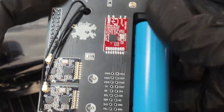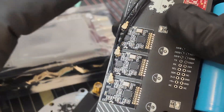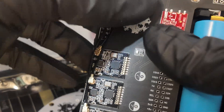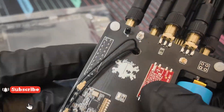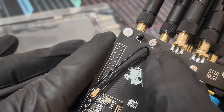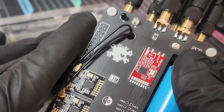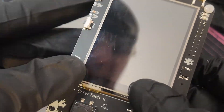This device is powered by a single 18650. You've got a CC1101, three NRF24s, and UFL connectors that connect to the SMAs. The SMAs are tuned to 2.4 gigahertz, and the CC1101 is tuned to 433 MHz. There's an infrared receiver and transmitter, although they do not work — that's a small issue. Hopefully he'll revisit this, but for now we're limited to what we have.